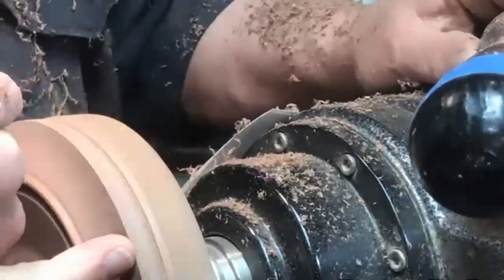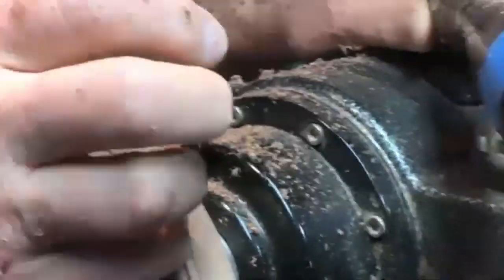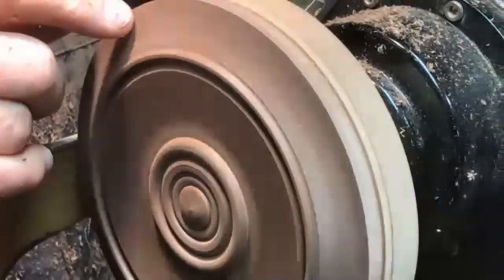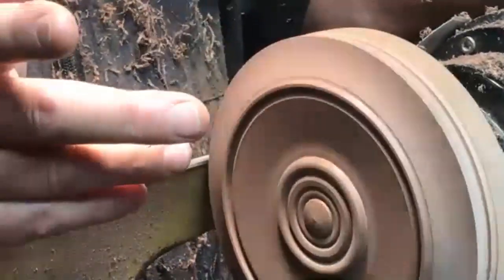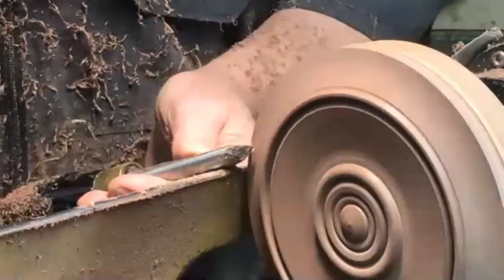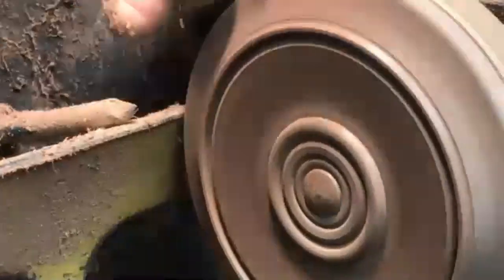Looking at the front here, that's a pretty sharp corner. This side here is rolled over - I'm going to roll it back in just because it prevents any damage being done to that sharp corner in use on a table. I'm going to start with the handle down, touch the edge, and roll it over again. I did not touch the top surface with the tool - I just worked toward the tip and as it rolled I backed out. Now the two sides look fairly equal and it's deep enough that when I take this off I won't have quite as sharp a corner on the back side.